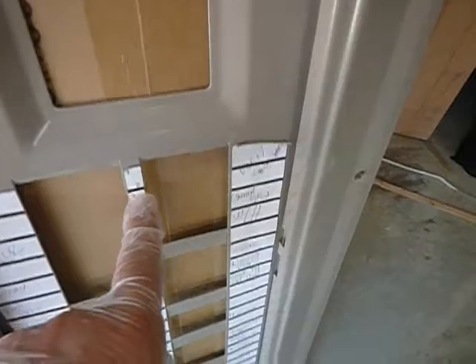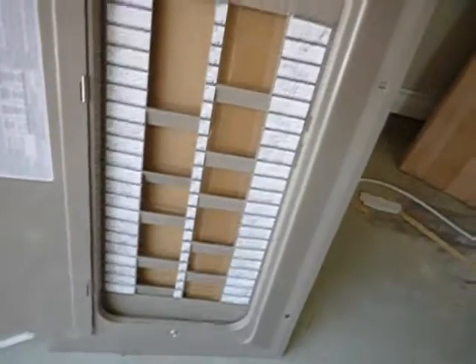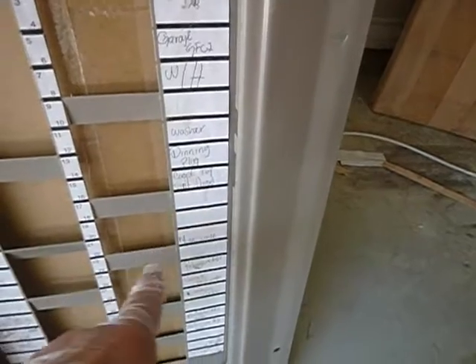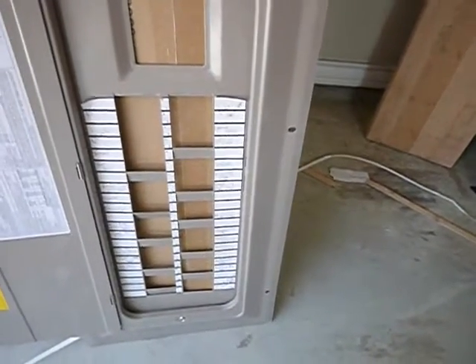The manufacturer requires printed labels and duplication. Looking at the panel, several sections are not filled out. For example, the microwave is only 120 volts — but several breaker labels are blank. That's not complete.